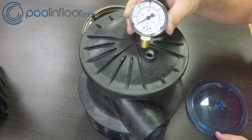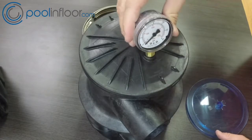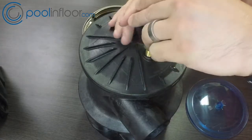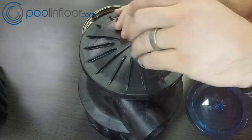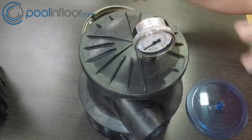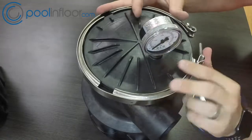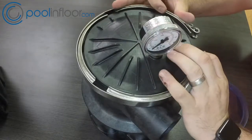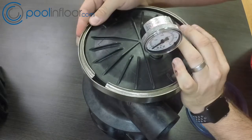With the black lid you can put a gauge on it so you can see what kind of pressure you're getting from the system — check for a blockage or backup. I personally like to see under 20 pounds of pressure on these. If there's anything more than that, there's usually a blockage, or maybe a different nozzle should be installed — a little bigger to allow more flow.